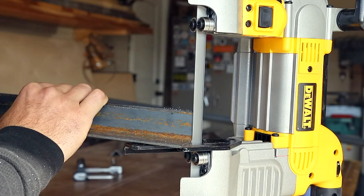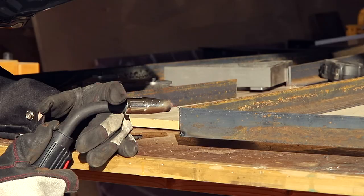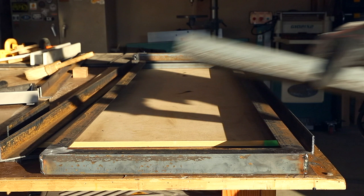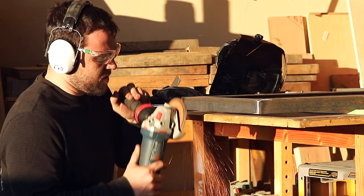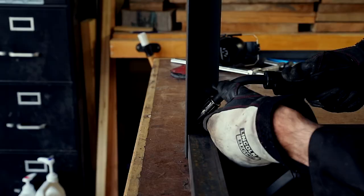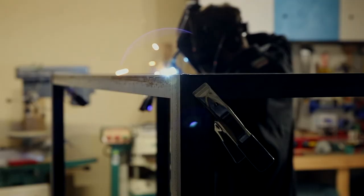We used the bandsaw to cut all the 45 degree angles on the angle iron and I feel like I get a better fitting miter cut this way. Next, we made sure the first frame was perfectly square before tacking and welding up all these joints. After building the first frame, we could build the second frame right on top of it knowing it would be square and line up perfectly. Here Richard is grinding down and rounding off the corners so they'll fit within the vertical support angle iron, which I cut next. These get welded from the underside first to the top frame and then the bottom frame creating the outer skeleton of the entire piece.